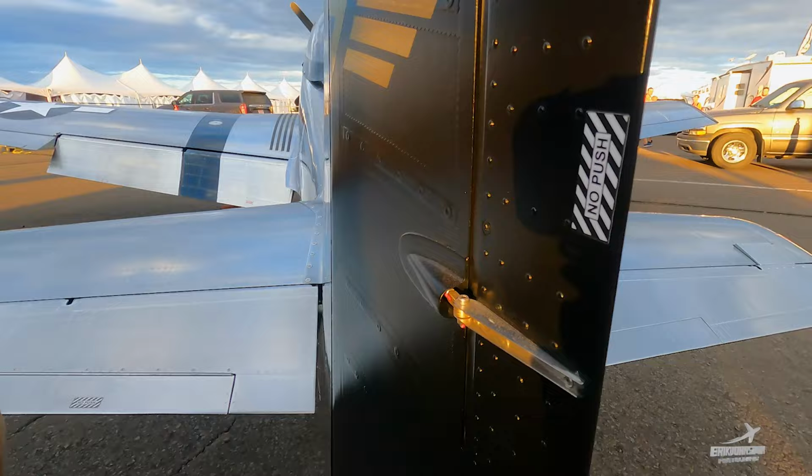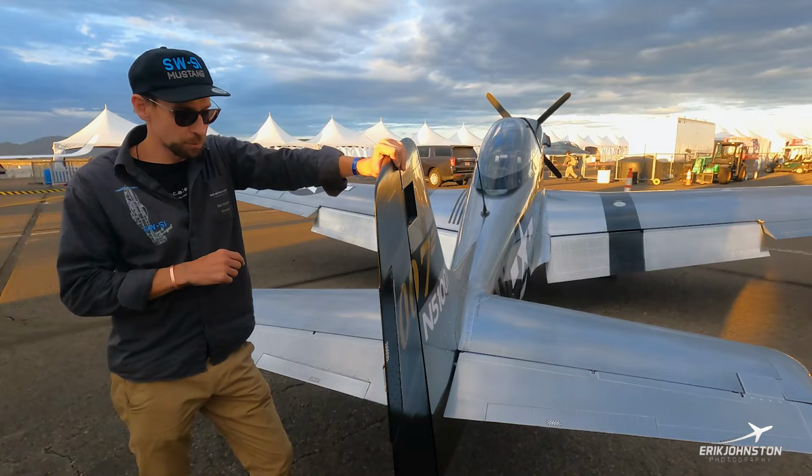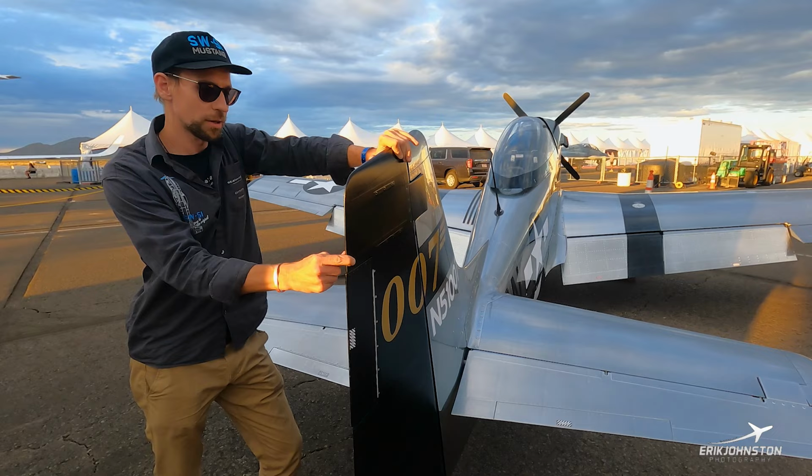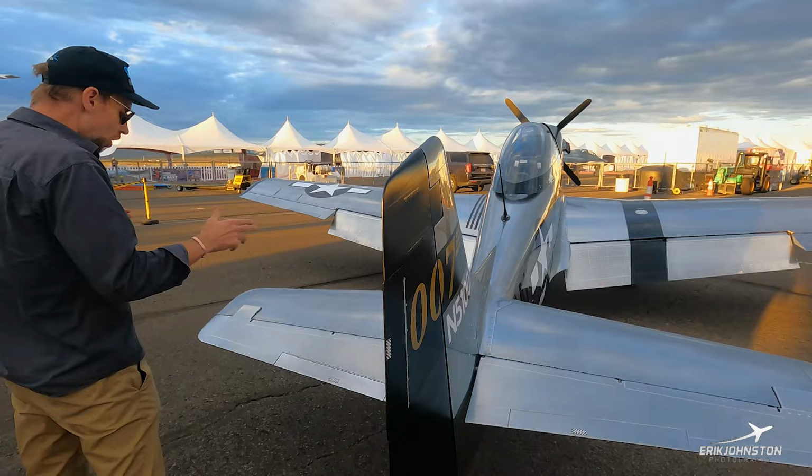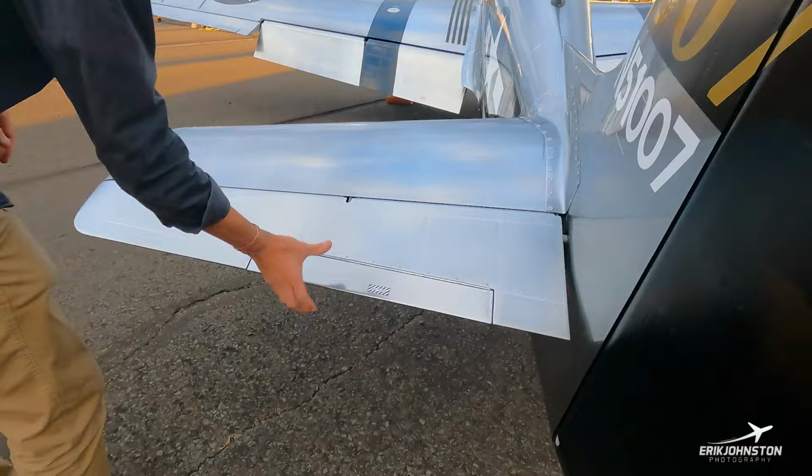You get the indication typically in your Garmin display. There you can see the position. You also feel it, and typically we have a little bit left deflection because that one is moving the rudder a little. Because you need a little bit right rudder for takeoff. Also, the elevator has an electrical trim. Here is the trim tab, so that one you can also use for trim.